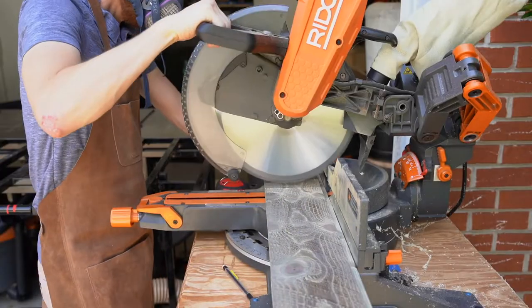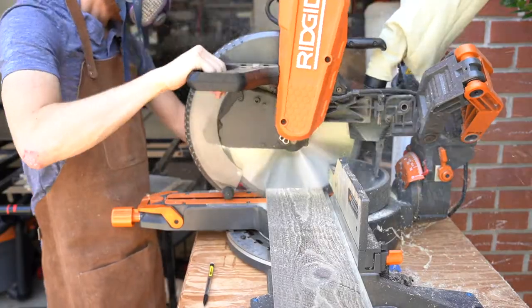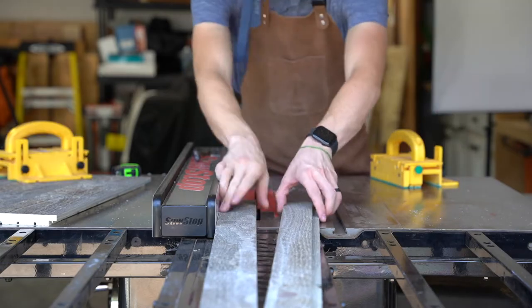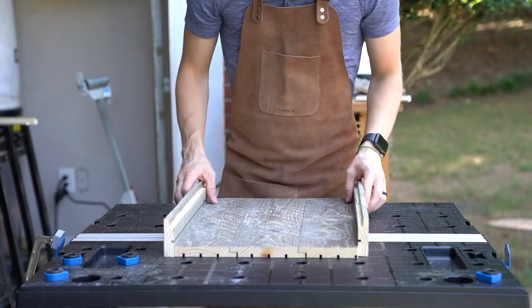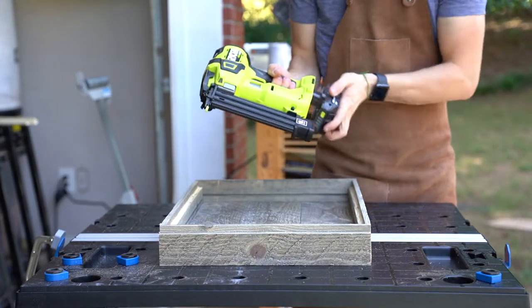The first step was cross-cutting three pieces at 18 inches long. In the leftover board, I took to the table saw and ripped it in half. You could do this with a jigsaw or a circular saw if you had to — just be safe. I then cut those thinner pieces into the lengths that would be the sides for my tray. I shaved off the edges of the outside board so that the sides would fit against it flush, and then it was time to assemble everything together.